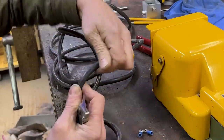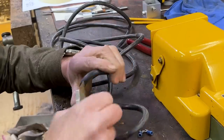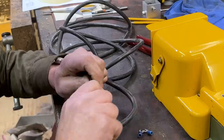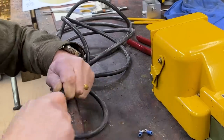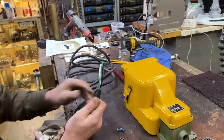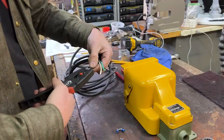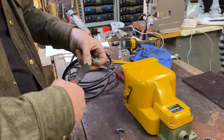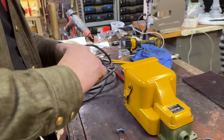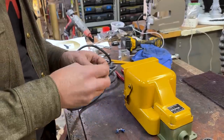You don't want nicked copper potentially causing a short. Especially with heavy conductor wire, a short can really spread some heat around and ruin your life. One, two, three — and no nicks down here. That's super important. We're going to pull out these guys — one, and two, and three. I don't think I'm going to need that last one, but I've stripped it just in case. And we're going to crimp some lugs on there.